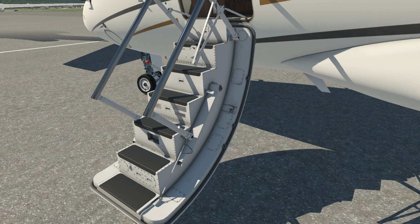And what I'm doing, just so you're aware of, is I'm looking at all of the components of the door. I'm specifically looking at the piano hinge, which is going to be back in this section here. And then I'm looking very carefully, and you're going to see a couple videos here shortly, of the door seal itself. The door seal is extremely important. It basically holds in the pressurization of the aircraft. If it's not in good condition or there's nicks or tears, that's not necessarily going to cause depressurization, but it's going to cause a loud whistling sound, which can be rather annoying to the passengers. So we'll go back to the slideshow.